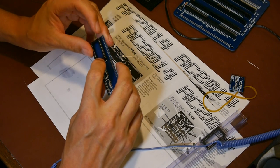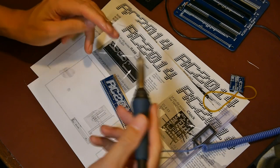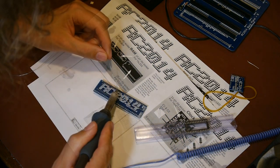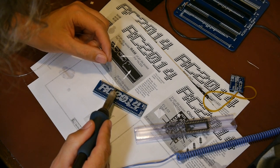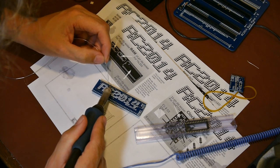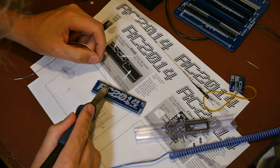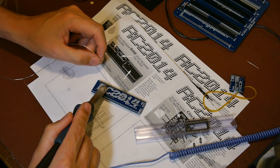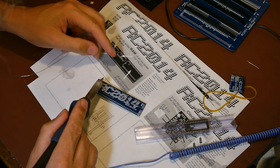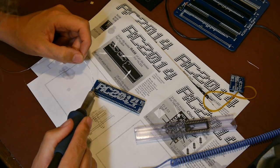Let's get this one nailed in. This big socket here — this is the 32K RAM, a 28-pin DIP socket. I've probably put this wrist strap on a little bit prematurely. My wife mentioned helping hands — I've always found those helping hands to be unhelpful. They always have really rubbish crocodile clips on arms, a magnifying glass that doesn't focus on anything, floppy rose joints that just flop around, and crocodile clips that are either dead tight or dead loose. I've bought them in the past and been suckered in like everybody else.